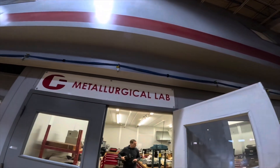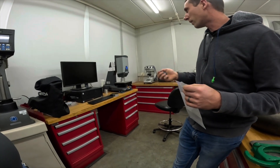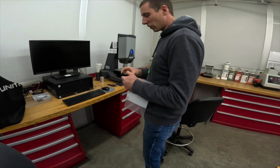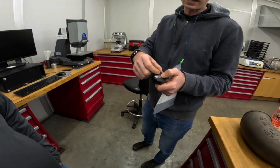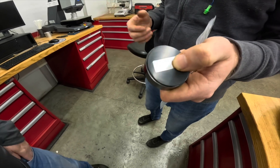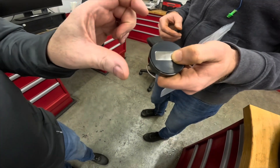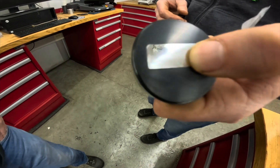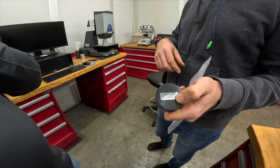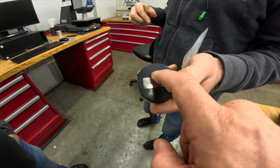When we do hardness tests, every single heat treat batch of pipe that goes through here runs through a micro hardness testing machine — this is it. It's fully automated. We can set it up and it takes seven rows of hits all along the wall thickness. We map it all out. We can't put the actual pipe section inside the machine because of the radiuses and funky shapes, so it's put into this little hockey puck. You can see the little dots in there — those are the points where the machine presses down to check hardness.